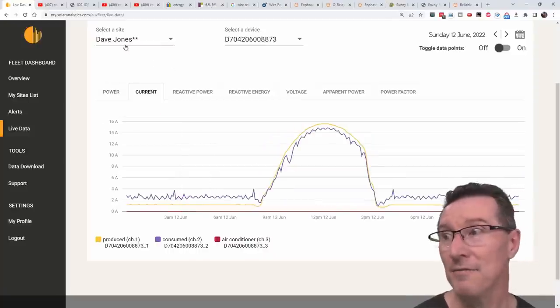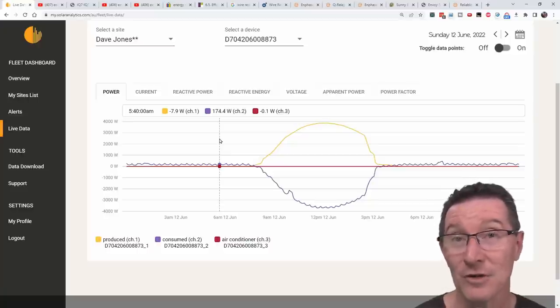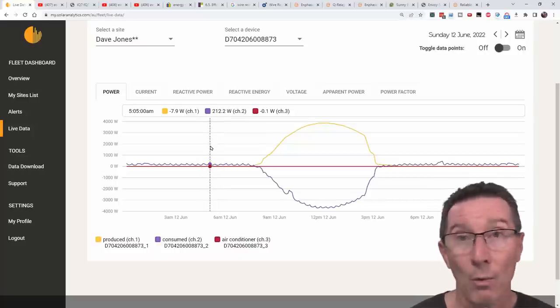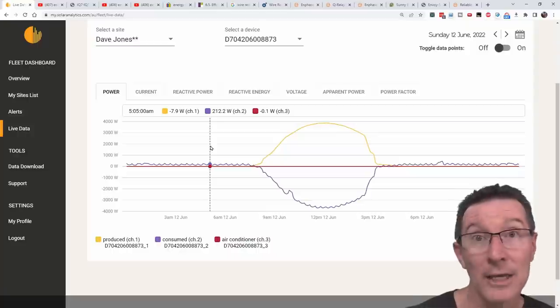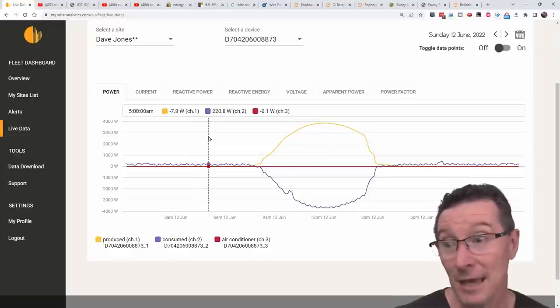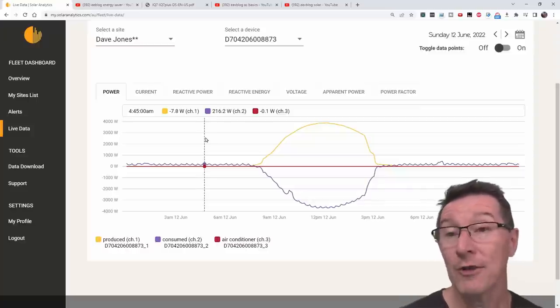Post-editing Dave here: I just got some info from Enphase that the actual power consumption of the Enphase inverters is 15 microamps. This is essentially zero. So this is the real measured power consumption — it's basically zero. So virtually zero of that 8 watts is the Enphase micro-inverters. As you can see, they basically draw naff all at night in terms of real power.